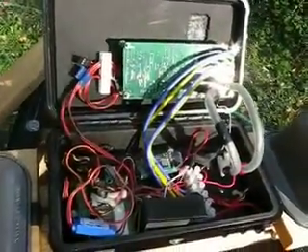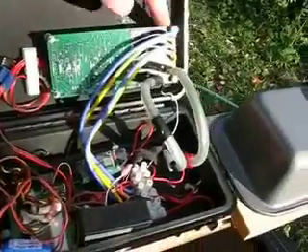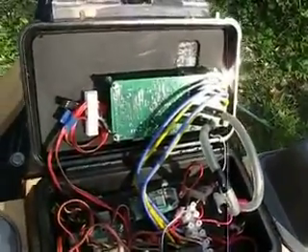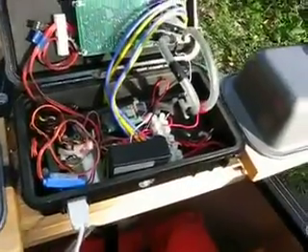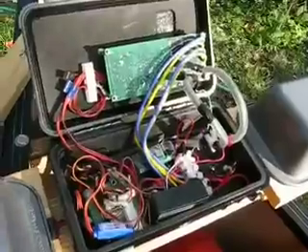What's ended up happening is that the heat generated by this motor controller — this is a RoboWars motor controller, an Australian BattleBot company makes it — it generates enough heat that I think ultimately I'm going to need to install a fan. Right now what I do is under way I actually leave the case cracked open a little bit, and then if it rains or anything I can still lock it down. But if you're running at full throttle it gets pretty warm.